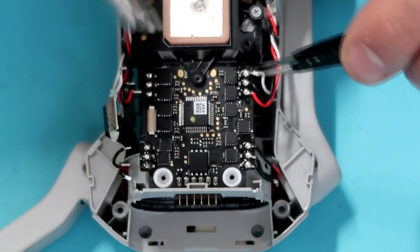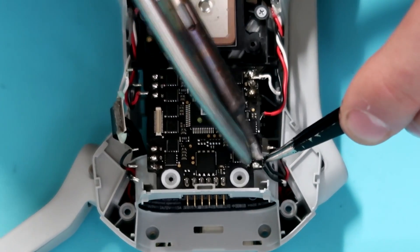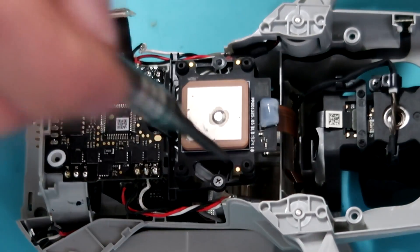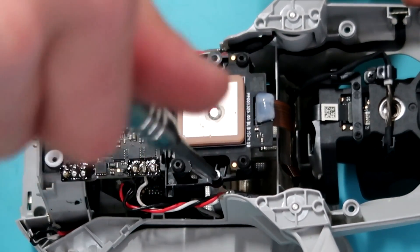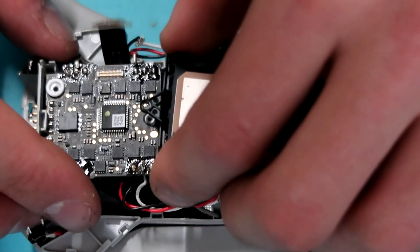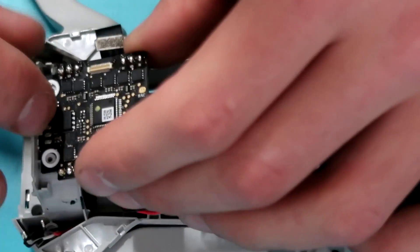If you don't feel comfortable doing it, you could always send it to DJI drone service and let the experts handle that. There are three wires per motor, so once you have those removed, we can go ahead and start removing the GPS slash IMU. There are two screws on the left and right side of the GPS slash IMU, and once those are out you can pull it out of the way of the 4-in-1 ESC and fully remove your 4-in-1 ESC board.